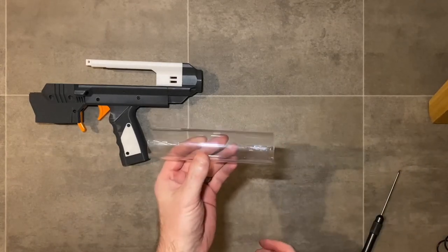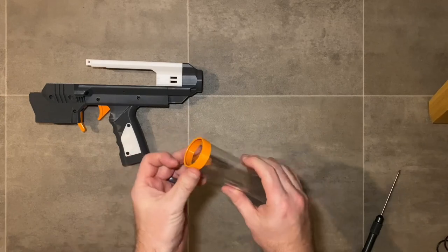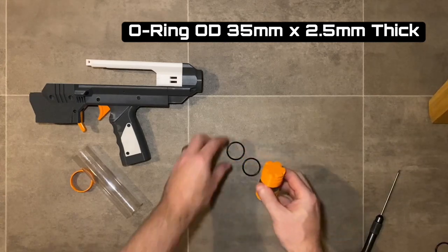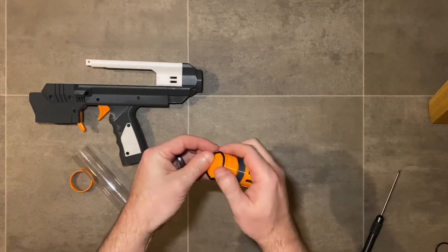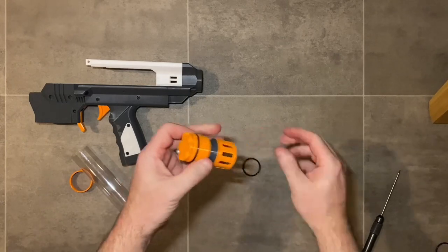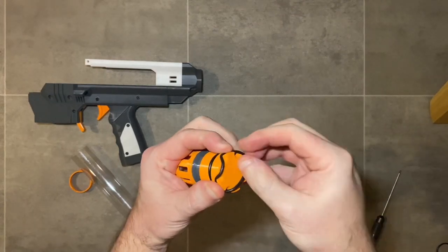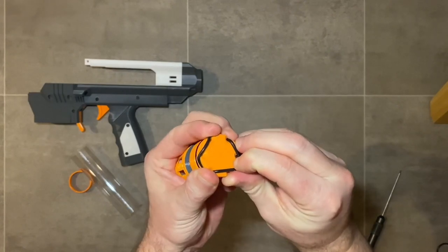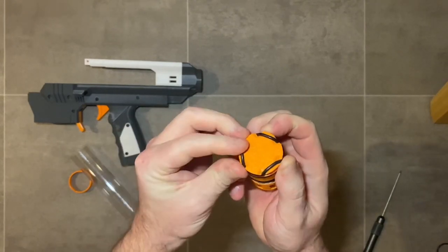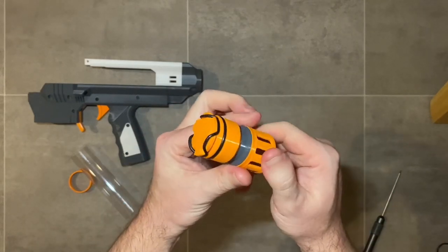The exact plunger tube specifications are in the description. The D012 tube cap short is used when using the full length tube — we'll install that a little later. Now use 35 millimeter outer diameter by 2.5 millimeter thick O-rings. The first O-ring goes on the rearward slot to provide the seal with the tube. The second O-ring goes in a castellated pattern to act as a crash or bump stop, stopping the plunger from smashing into the breech. It can be a little tricky to install — massage the rubber so it forms that nice shape.